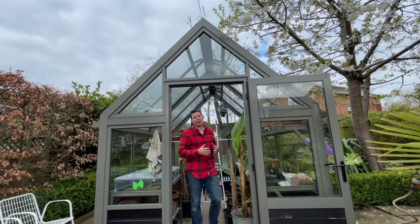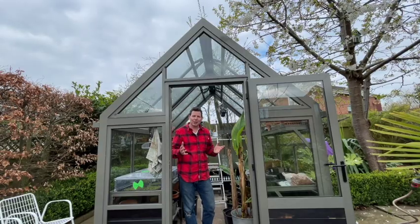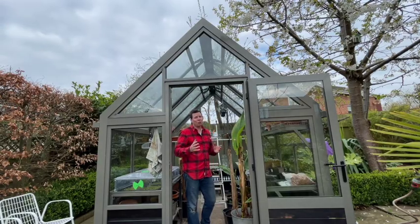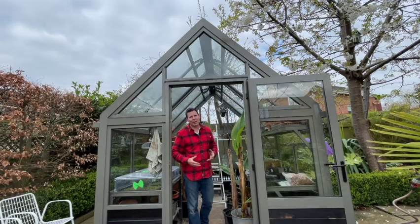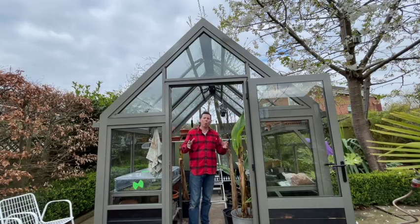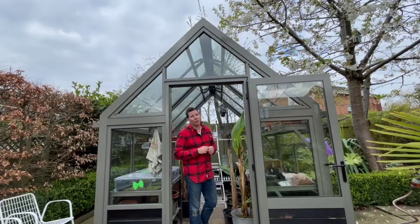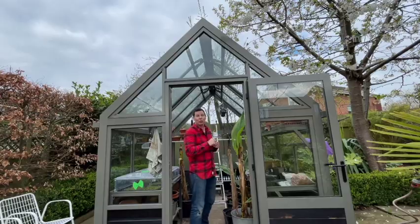I've brought the ladder into the greenhouse today because I want to talk to you about automatic ventilation on greenhouses. If you find you've got auto vents and they're not opening, there could be a couple of reasons for this. First and foremost, it just may not be warm enough. In autumn, winter or early spring, the sun might be out and things might get warm in the greenhouse, but probably not warm enough for a period of hours for the wax in those cylinders to expand and open the vents. But if it's warm outside and inside and they're still not opening, then here's something to check.